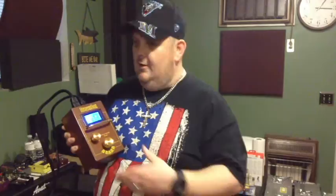What does it do? Well, it actually shows you the volts that are coming through the wall and then you are able to set this knob to the voltage. And then, of course, you can drop the voltage down if it's too high or your amp is not working too hard. Guys, this is just the most crazy awesome blessing for guitar players because now we don't have to push our amps to work too hard at a higher voltage than what our amp is rated at.